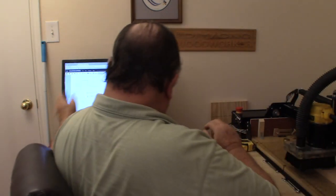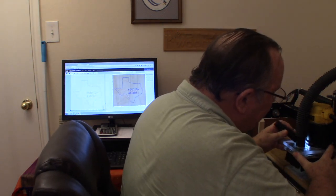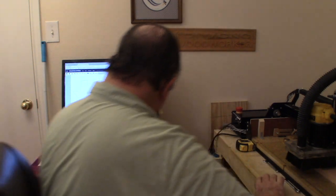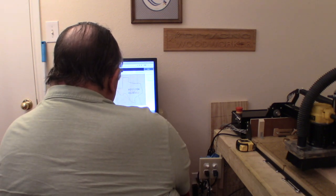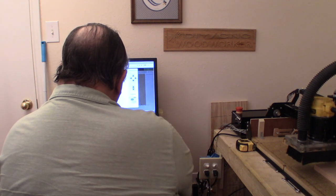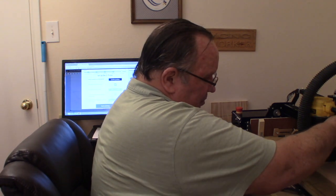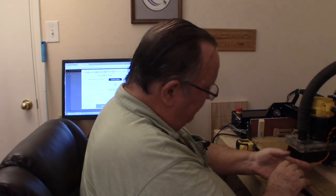Now, what I want to do is set this XY position on this thing approximately close. That's good enough. Now, I want to turn it back on so I can do a carve. I'm going to run this up. Confirm the thickness, secure the bit, use the probe. Once again, plug my probe into its freshly made probe mount position. Hook that up.